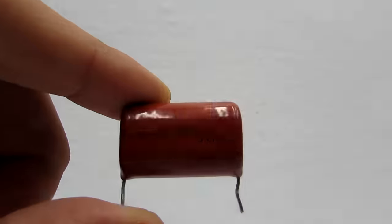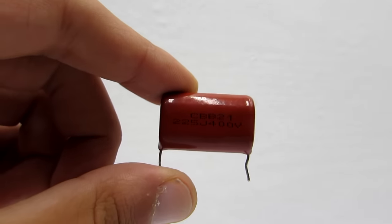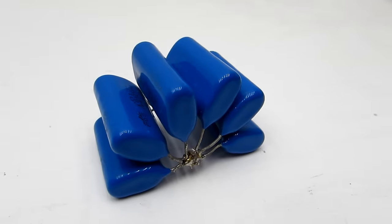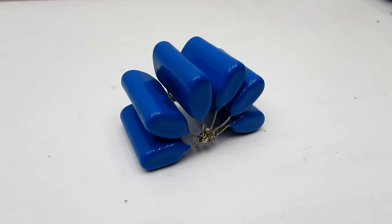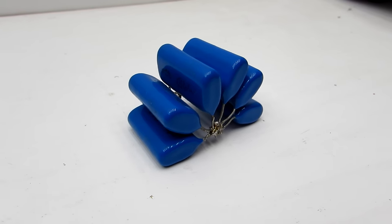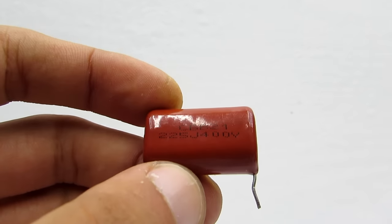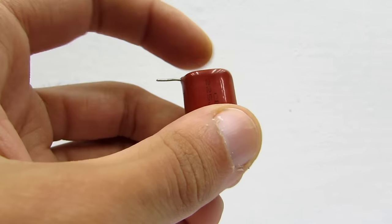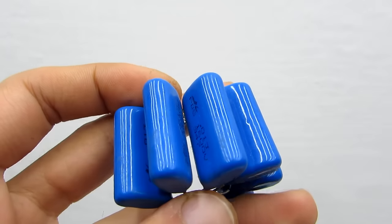if the core is absent or it is not closed, therefore I advise you to use a battery of capacitors connected in parallel with a total capacity of 1 to 4.7 microfarads and voltage of 630 to 1600 volts. Optimally is 1000 volts. Practice shows that 400 volts is not enough. In the case of the capacitor bank, all should have the same capacity and voltage.